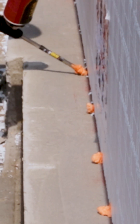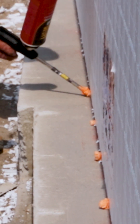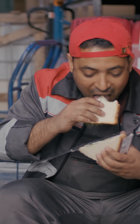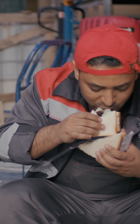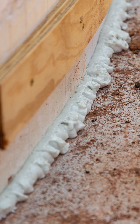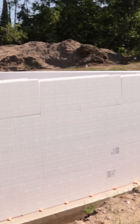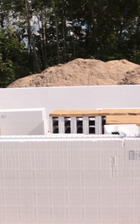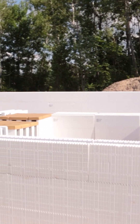We go through and spot glue every couple of feet and let that set up. I train the install crews to do that right before lunch or right at the end of the day, so the glue has time to set and bond. When you come back from lunch, it's adhered. As soon as it bonds and all the expansion is done, you can come through and glue it solid — at that point it's not going to lift.